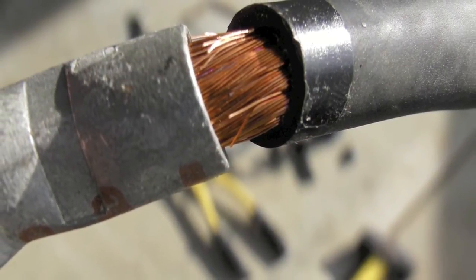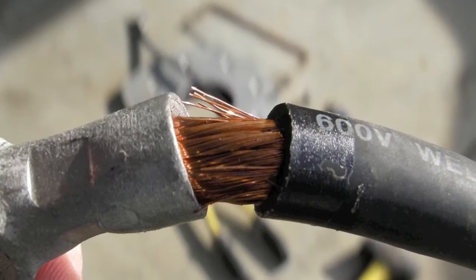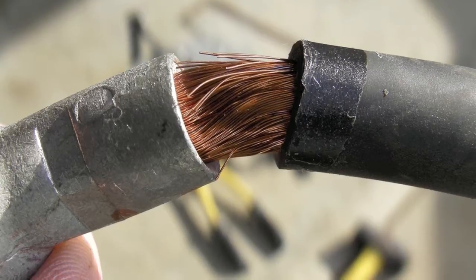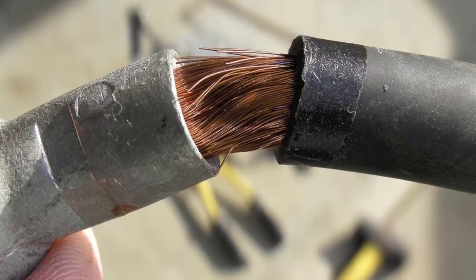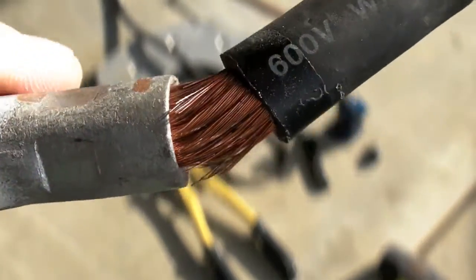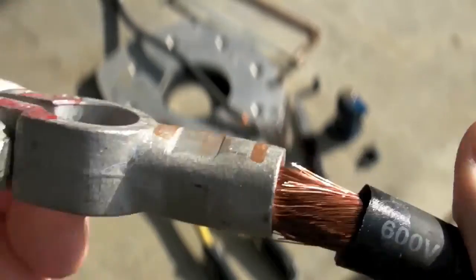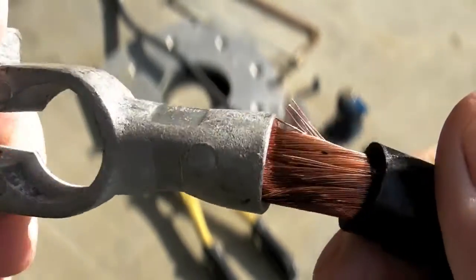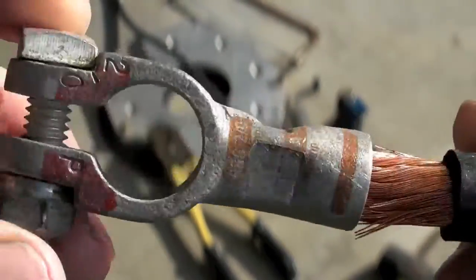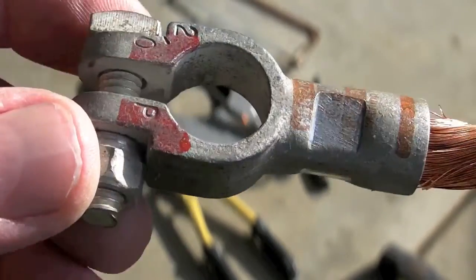Here are the new pictures — definitely good quality pictures of the hex crimp. A lot of frayed wires. The crimp looks good but frayed wires just aren't gonna cut it. Looks like quite a few loose wires from that — not very good quality. It's crimped, it looks better, the crimp looks better, but in the end how well does it hold up?